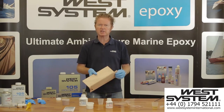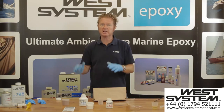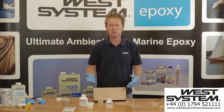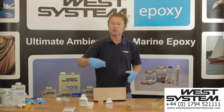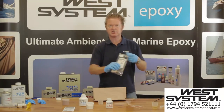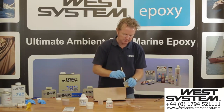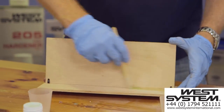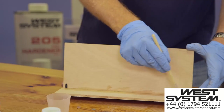For more advanced techniques, we would really advocate best practice, a technique that we refer to as two-step bonding. Two-step bonding is very simple. We prime a porous surface with the West System resin and hardener mix and let that wick into the plywood before then creating a fillet. Now, to do that with our mini pack, we really need to purchase some West System glue brushes. And two-step bonding focuses on brushing the resin and hardener mix into the porous surface before we use a secondary technique. So we can use that very effectively with our filleting process.